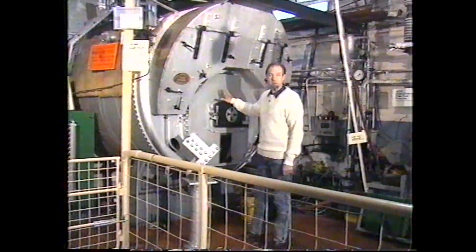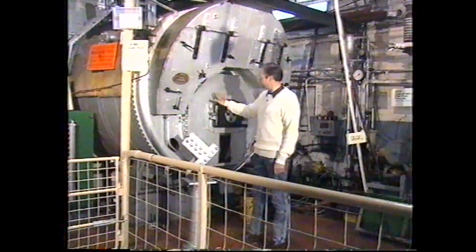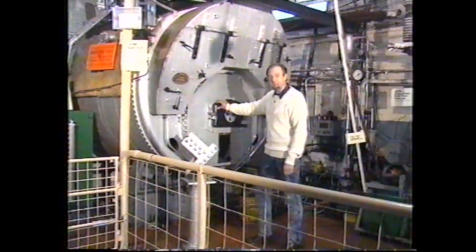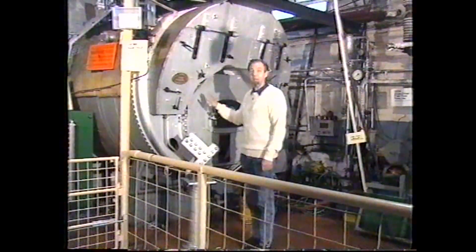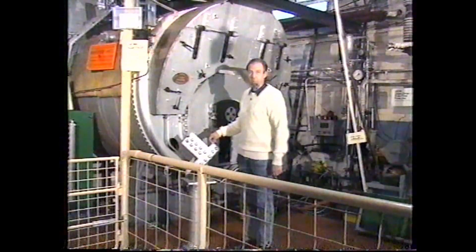And this is where the process started. It was the same principle — this is like Dean's tin can boiler. Inside there, 20 tonnes of wood were required to build up steam over three days, which was then piped off to the steam engine. In fact, this was one of four boilers that collectively drove the largest beam engine in the southern hemisphere. Now just as with the tin can, the seam is a dangerous point — it can be the weakest point and the thing could rupture.